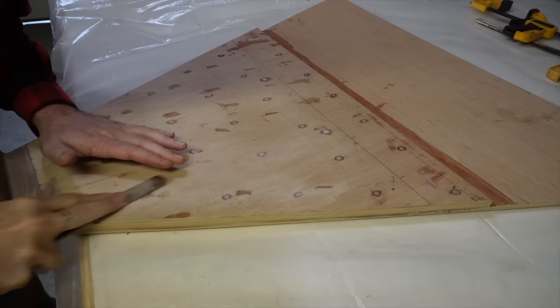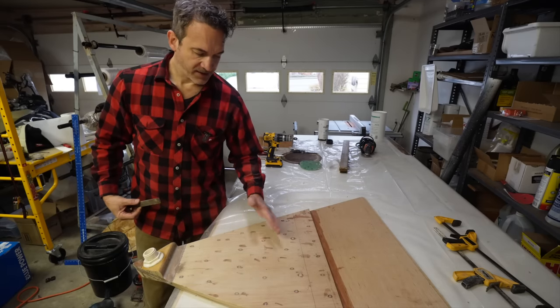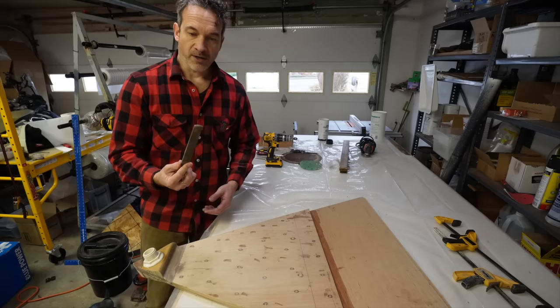This one has a double cut, and that's just because it's easy to keep things more flat that way. Get out the sander here, and the hard spot epoxies will knock down slower than the wood around it. You'll tend to get a wavy finish, so we're gonna use the file.